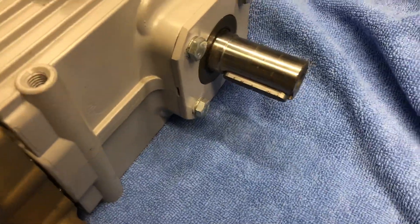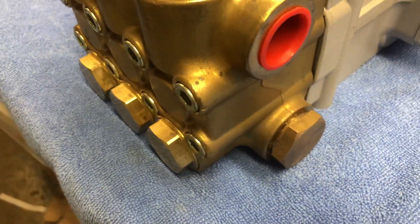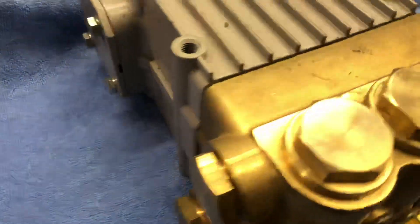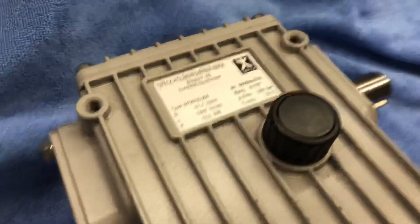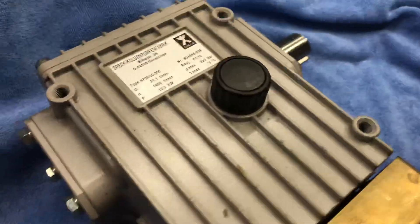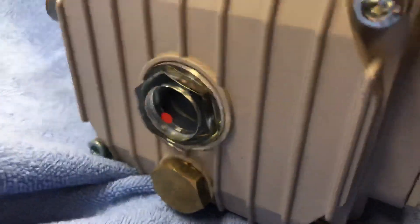The shaft size there is a 28mm keyway shaft. You've got your water inlet 3/4 inch at both sides. You've got the outlet side on that. You've got the cap on the top there — oil. And then if we go to the back end and tilt it round, you'll then see what I've simply got is an oil sighting glass.